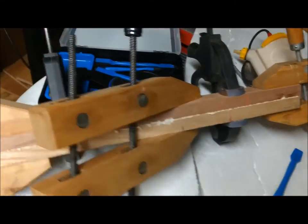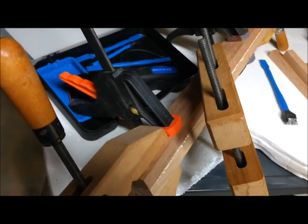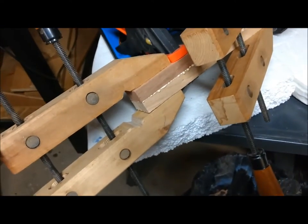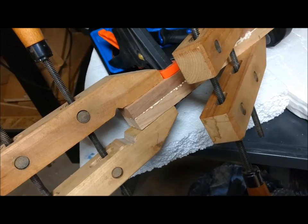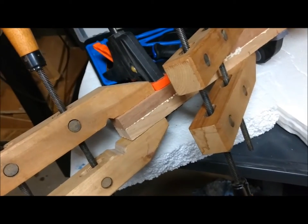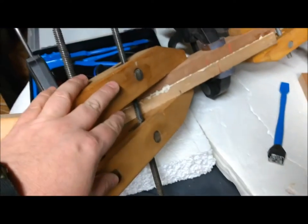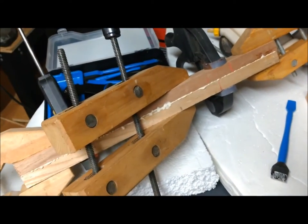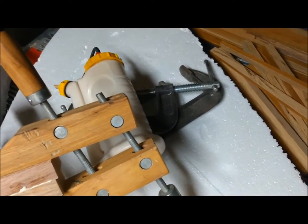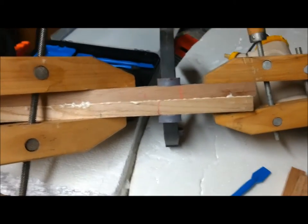I'm not a huge fan of the actual clamps though — they're knockoffs, kind of junky, and I keep breaking them. I'm going to be replacing them. But these wooden ones I've had — gosh — 20-plus years, and they're still kicking it like Bruce Lee. So quick clamps go on there first, those will come off. I put three on here, these two will come off, then I can go to the next and put clamps on there. Then I can put some lesser ones that take more fussing and fiddling, but I'll scrape the glue off here.